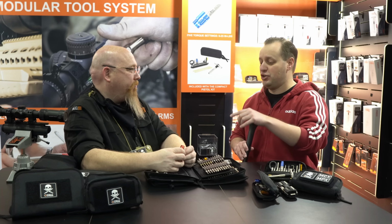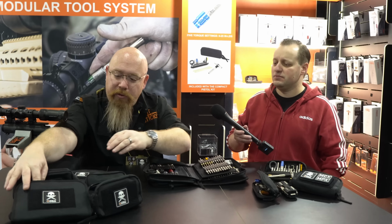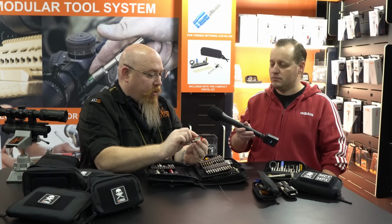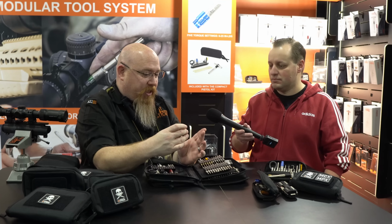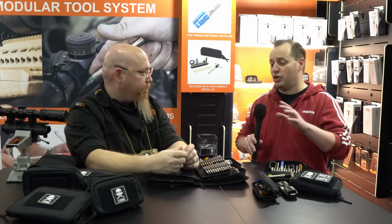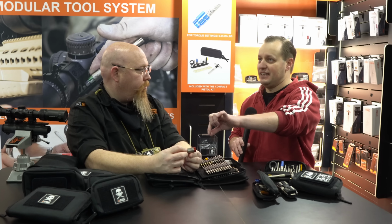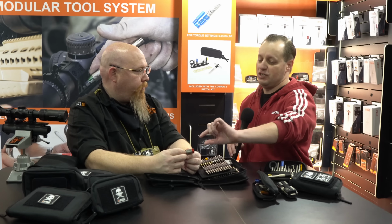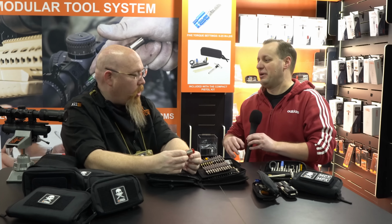Alex, I guess if you wanted something that you don't have to look at, or if you have vision problems, you can use the torque limiters for that. So if we're going to use a dedicated torque value, we offer these as an option. It would have the dedicated inch pounds, and there is a difference between inch pounds and foot pounds. This is going to be 65 inch pounds in this case. You would basically use that and turn until you just feel a click. That's it. So a good way of thinking about those, the big distinction, would be that the torque limiters are kind of like an individually set torque wrench, but for each particular value. Correct. Versus the torque driver, which is almost like a scale built into a fastener or into a socket. 100%, that's correct.